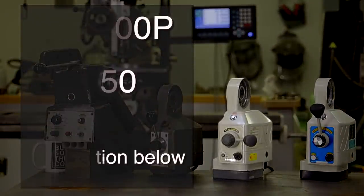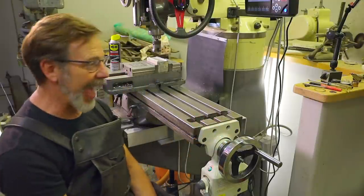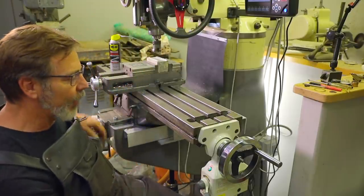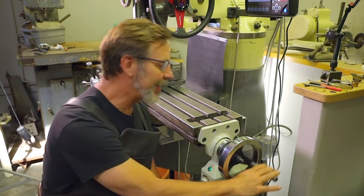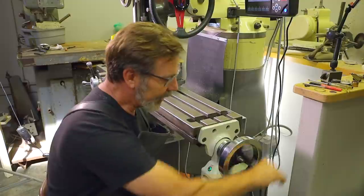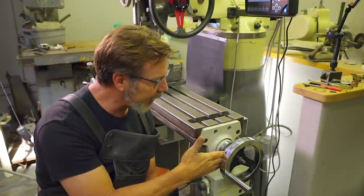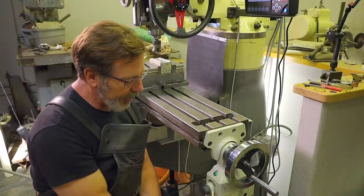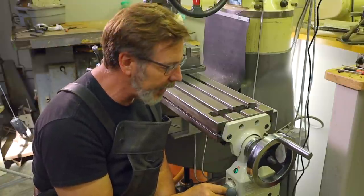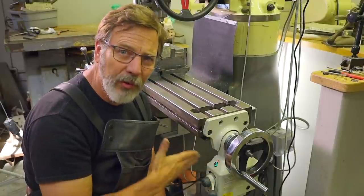It's time to look at the AL500P, made by Workhorse — it's a really great machine. This one is actually set up for the Y-axis, so I had to do some modifications to make it work in the X position. The gear here wouldn't fit, so I had to use the one off the servo, but it still feels nice and solid. This one uses shims to adjust and fit everything together instead of that spring washer. The forward and reverse sounds nice and solid, and the speeds are really nice — it crawls nicely and goes through the whole range of power very smoothly.